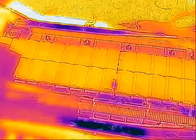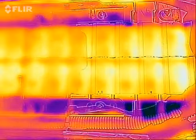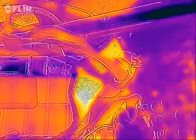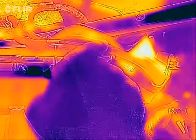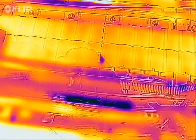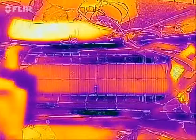But the batteries themselves are not too warm. We're looking at essentially plastic covers over the top of the batteries. The batteries themselves, if you look down and see those purplish areas, they're covered with aluminum — they're actually relatively cool. The brightest thing in the image right now is actually some black non-conductive material. Here is one of the cords carrying current into the battery pack, but right now the hottest thing is not the batteries and not the cables with current going through them — it's simply anything that's black and in the sun.